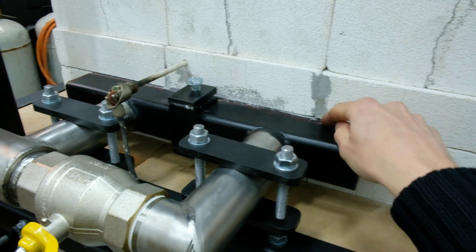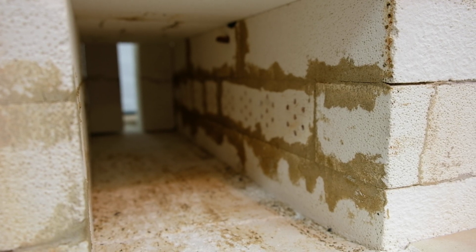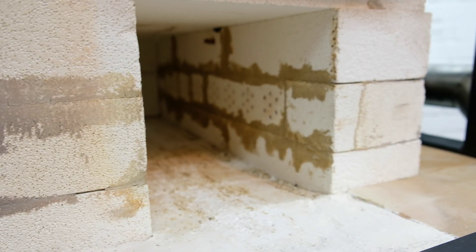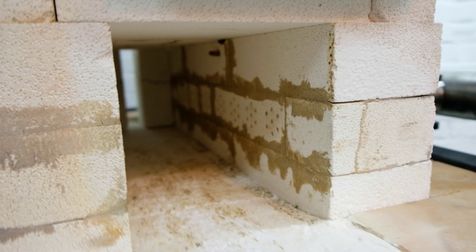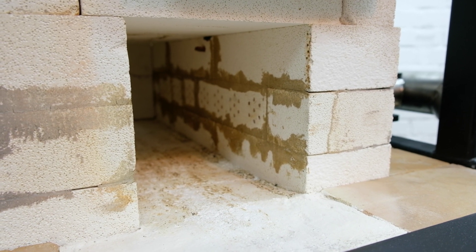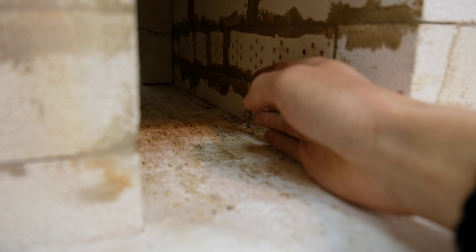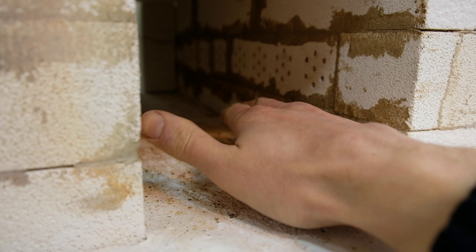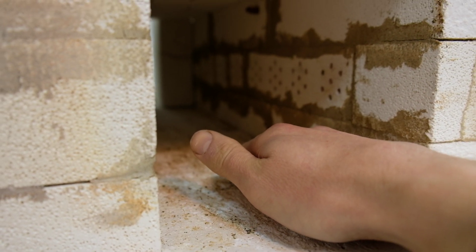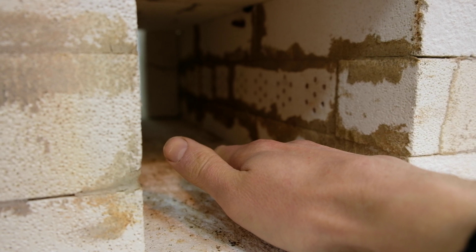The burners are connected with high temperature silicone kit. Usually they are cast from refractory, and that is probably a very good idea, but I decided just to drill holes in insulating fire bricks and it actually works. I've been using this forge four times now up to 1400 degrees Celsius and they're holding up fine. Time will tell if they hold up against abuse from material which slams into the side, and maybe in time I will need to also cast it from refractory, but we'll see.